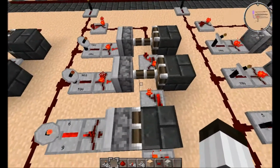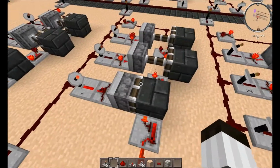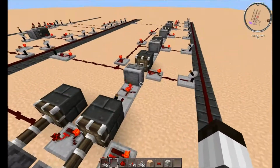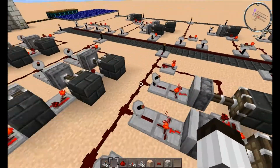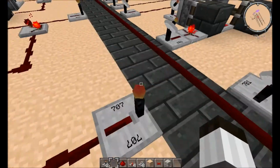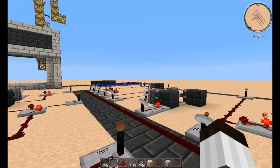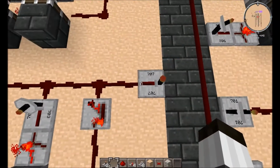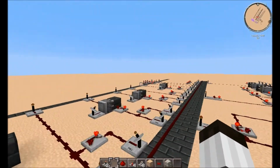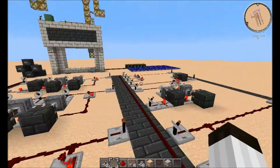These are our switches. This is a normally open switch. This is a normally closed one. The normally closed ones too. These ones are relays. They're wireless transmitters. It just makes it easier because there's no wires going everywhere. But they're numbered what they'd actually be in the actual program. There's a few counters down there. Those are in the 900s like they should be.